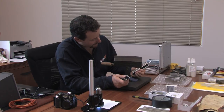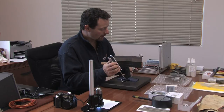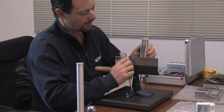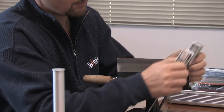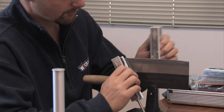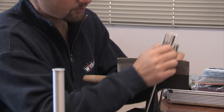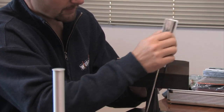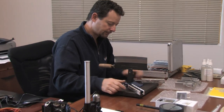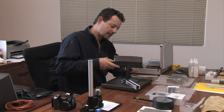To finish up this knife — the CCK 1303 that I got from Chef's Knives To Go — I'm going to use these strops that are treated with a 0.25 micron spray from Hand America. I can do just a variety of different strokes here: real long, smooth ones like that, or a series of shorter ones straight up and down. That looks really good. I'm about ready to go ahead and take this out of the clamp and stick it under the microscope to see how the edge looks.